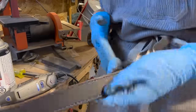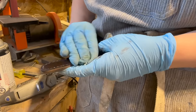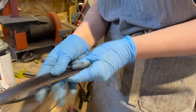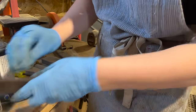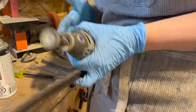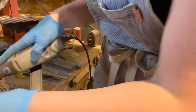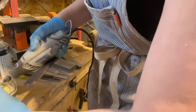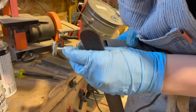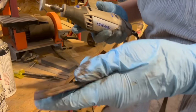Okay, now that it's dry, I'm gonna get this hard wax oil on the whole thing. Get it in everywhere. Good stuff. And I'm gonna take my buffing wheel and get wax in it to get the wax spread around. And then for the edge, I'm gonna burnish it with the inside of this hard piece. I'm not a leather worker, but this is a quick way that I do this, so I'll just show you the results.